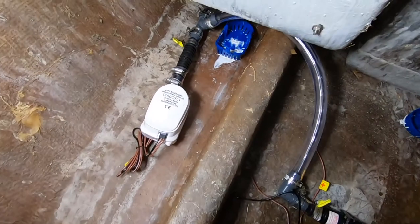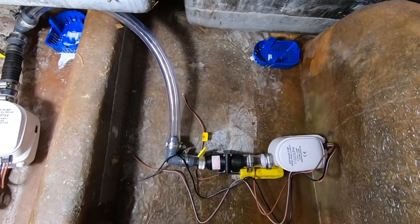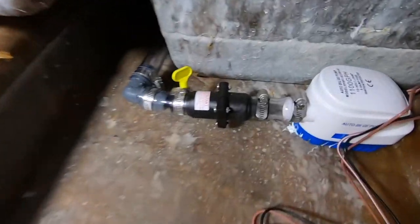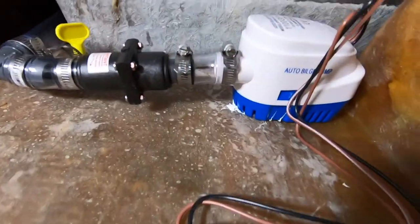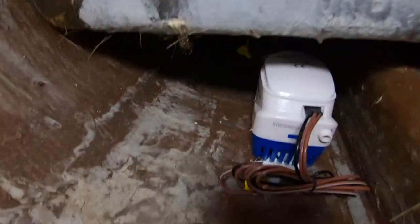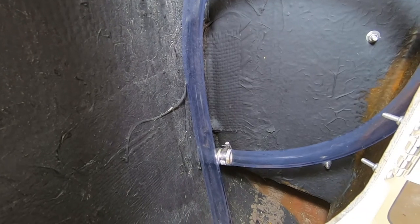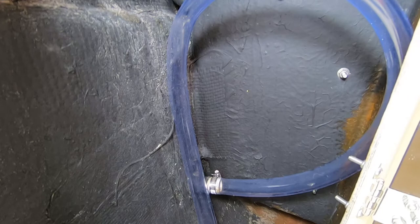Here we are looking at the starboard side pumps — a combination of elbows, tees, and hose clamps, with the check valves installed just before the pump. We mounted the bases with some caulking so we could slide the pumps into place and click them in. We did this as far back as possible to clear the cooler compartment that will fill most of this space. The hose goes under the head and out the through hole under the bathroom sink. We loop the hose and attempt to keep water from coming in, as the through holes are very low.